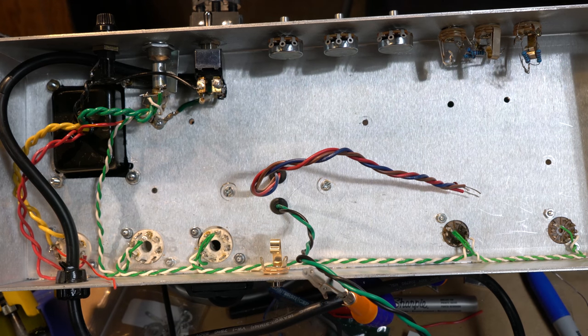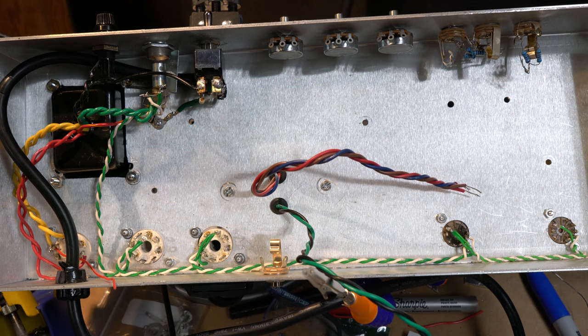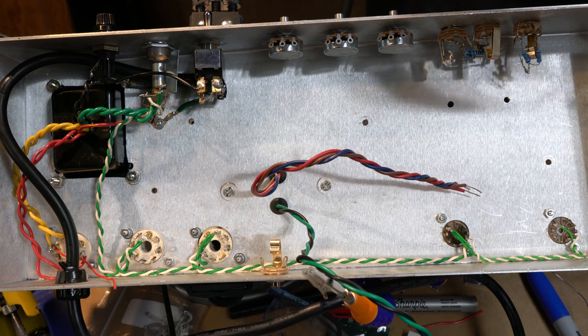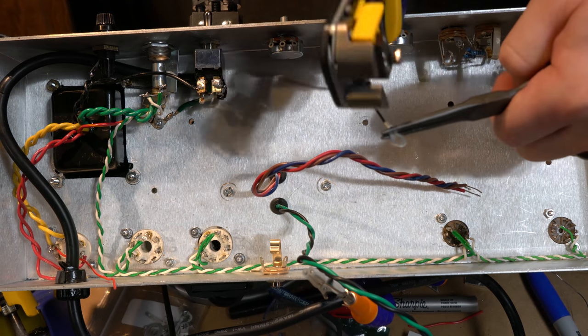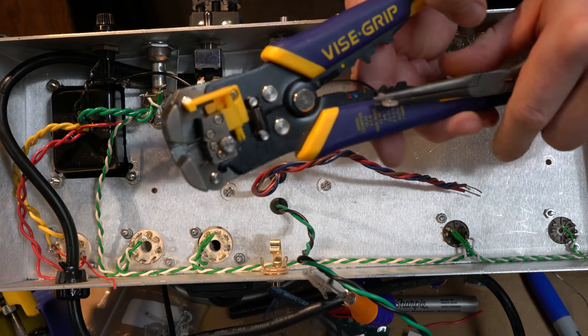So what I'm going to do is use that power tube connector to do it. So I've got some small 18 gauge here. All right, so what I want to do here is get a really good pinch connection. You can see here, I want to slide that in a little bit more. I basically am going to crimp that. And I want to crimp it so that this pinches physically tightly down on it. And I've got a little thing here that tells me where my 22 to 14 range is right here.